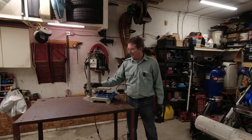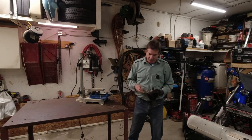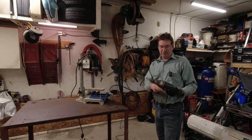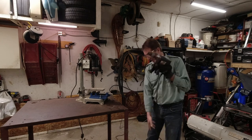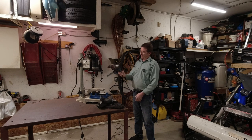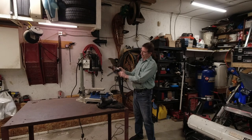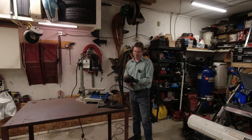So you want to be able to adjust this. There are a couple of different ways of doing it. I could buy something that goes on with a wheel to adjust the speed up and down. Or, because he had a spare drill in his pile of stuff he was throwing out, he had this one. It's a hammer drill — hammer mode, and then also a straight drill. So this is variable. You're going to lock the trigger down and adjust the screw here to the different speeds. It's an old Skil — all the stuff was fairly old.